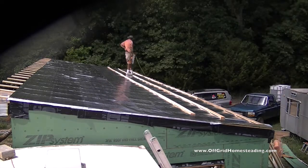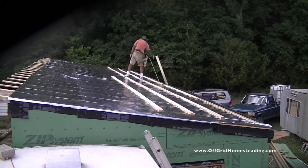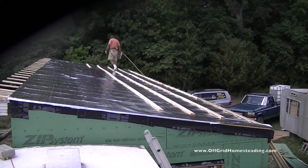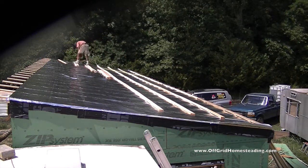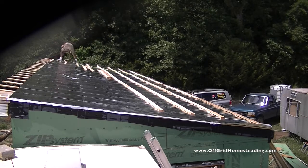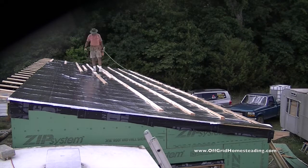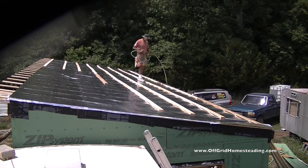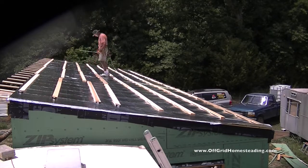I decided to line everything up from the far west side to just before the end piece in front, cutting those purlins to the right size. Apologies for the black section in the top left of the camera — the automatic lens opener didn't fully open and I didn't notice it. Kelly was down there being my purlin helper, handing things up. I thought walking on the foil was going to be tricky, but it was actually easy to spot the purlins below and step on those. The roof was dry and easy to walk on, but toward the very end it started to drizzle, so we took a break and got some ice.